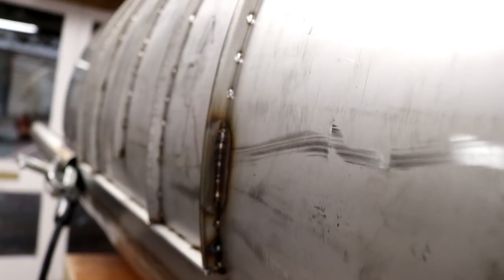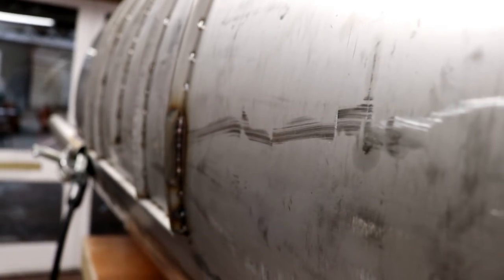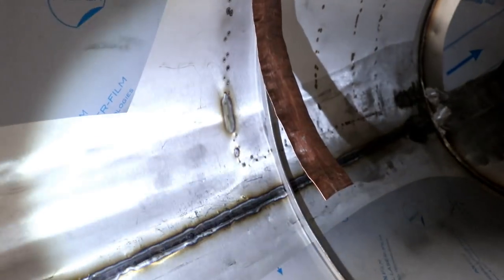We had a quick go at it but I'm not comfortable and I was slow, so I put a lot of heat into that weld. If I grab the torch and we have a look on the inside, there's a little bit of coking coming through on the back in two places. The sheet of copper wasn't clamped perfectly to the back, so I'll reposition that and make sure I am backing tightly the bit of weld that I'm going for.